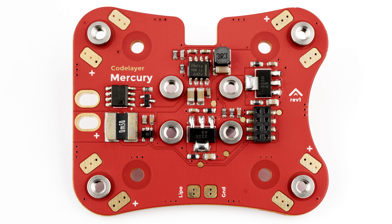The PDB can handle up to 6S LiPo voltage and features a 120-amp current sensor. Also included is automotive-grade reverse polarity protection for the entire stack, designed to handle engine cranking and harsh electrical environments. Finally, there are two channels of cascading switching and linear regulators to ensure that the power supply to the rest of the stack is really scrubbed clean.